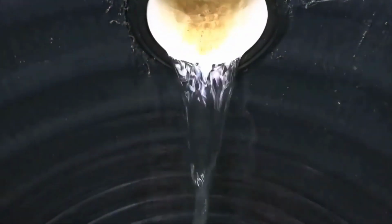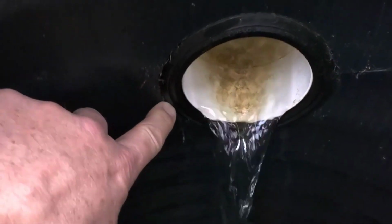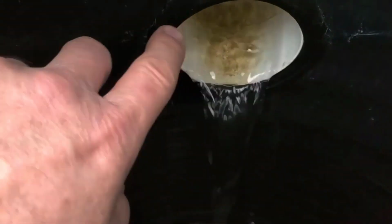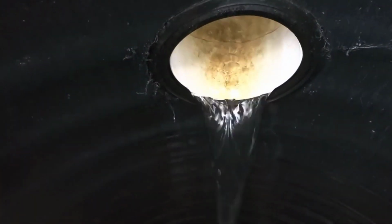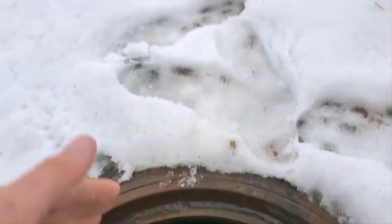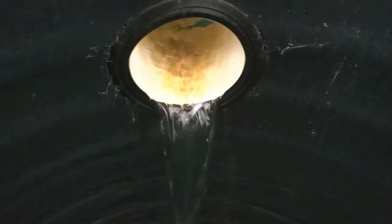Now that's the cone, we call it the AKA cone, 4x4, SDR to corrugated. And then we use one of those compression seals, because if you don't put a compression seal here, you just cut a hole, what happens, dirt will slowly fall into the sump. It doesn't hurt the sump pump because it's going to be able to take that dirt and inject it no problem. But then you end up with this erosion and it gets hollow next to your outdoor sump pump basin. So that's why those rubber seals are so important. You see that we put them in for everything.